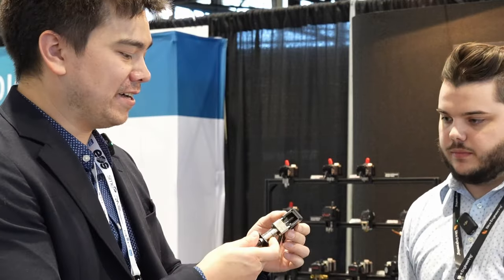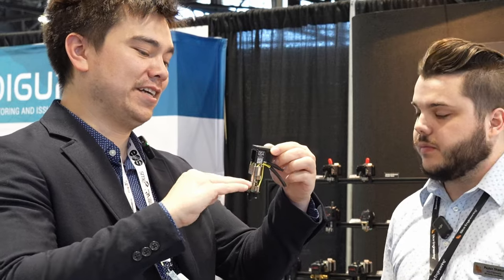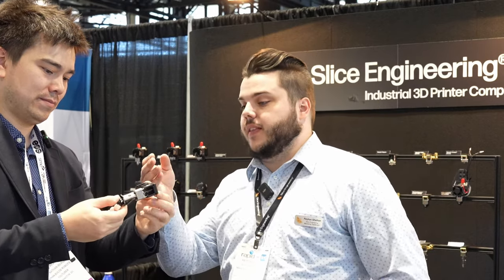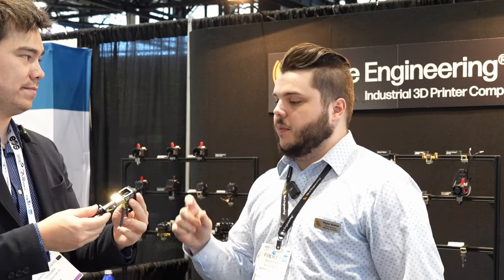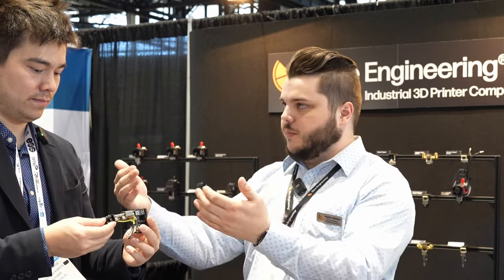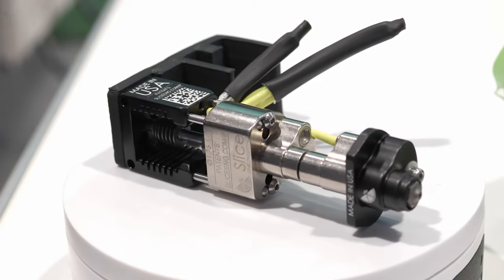I was looking at it earlier, and I noticed there's some really special features on here. One is that it looks like there's a heat break in the middle of the hotend — what's going on with that? That's exactly what is kind of happening there. It's a second heat break to better manage the two melt zones. You're able to have better temperature control in each area. This temperature sensor — we want it to read the temperature of the bottom, isolating that zone so we can have better management of each of those independent heating zones.